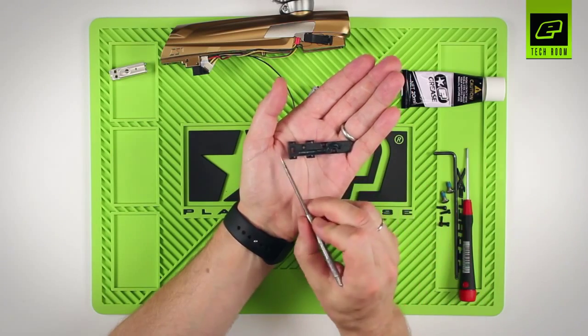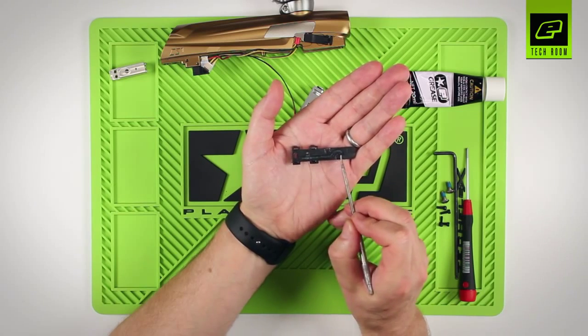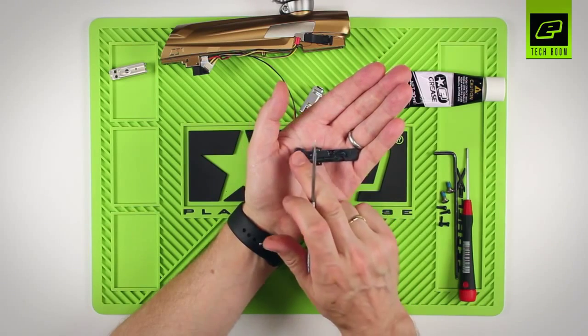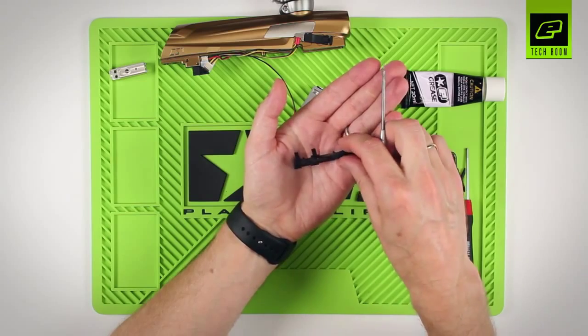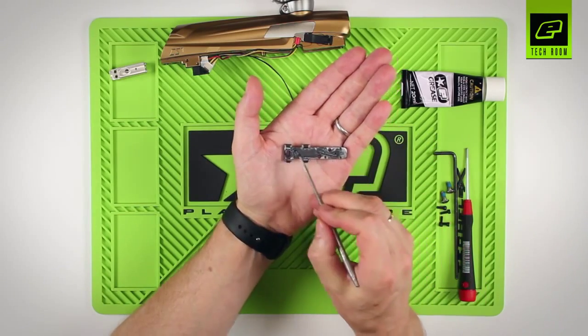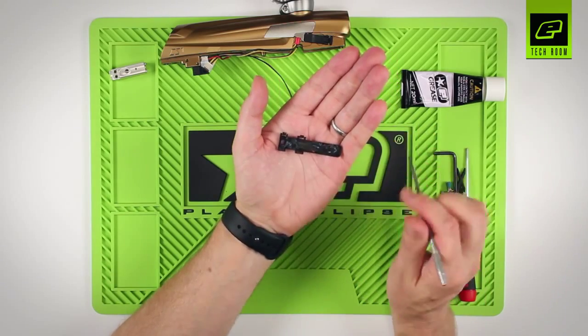As with any gaskets, make sure they're clean, not damaged, not scratched, not bent or peeled in any way, or have been trapped between the body and the manifold plate at any time. You have a very light application of grease, and the grease really is just there to hold them in place while you're assembling and disassembling. Again, make sure all 3 gaskets are sat nicely in their troughs inside the manifold plate.